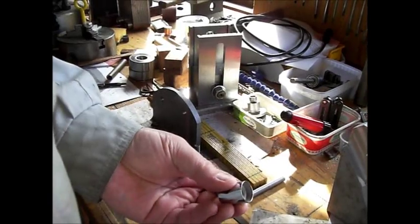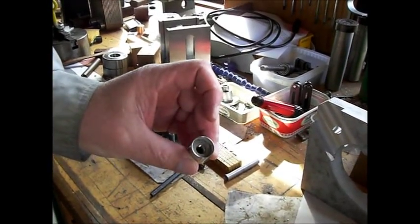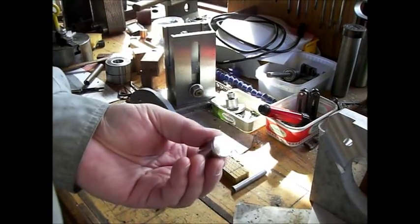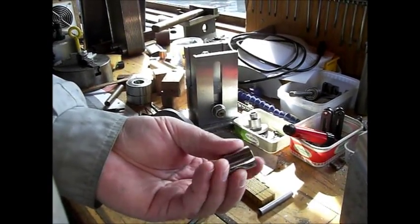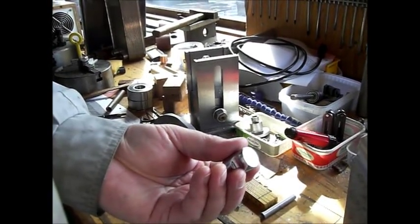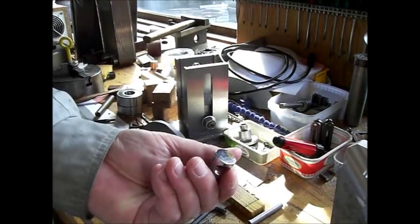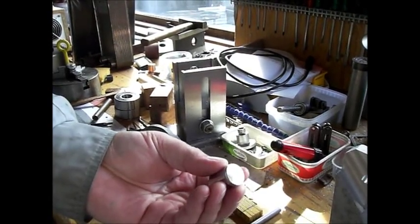There's a little special thread in here — 10 millimeters with a pitch of 1.25 millimeter. I think I'll make it in stainless steel. This here is brass or something like that, with a coat of chrome. But as you can see, it's falling off after 30 years.